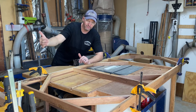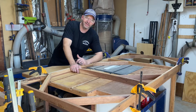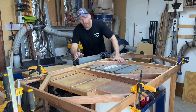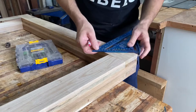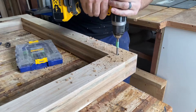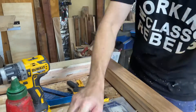So I've got my frame, and the two end legs. I'll now start to pull this old dining table apart so I can salvage the top, clean it up, and get all this put together. Also, this thing is very square — I'll check. Just chucking in a couple of dowel pins — one because they look cool, and two it's really going to strengthen up this bridle joint, just in case the table cops a bit of heat.